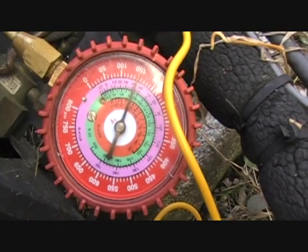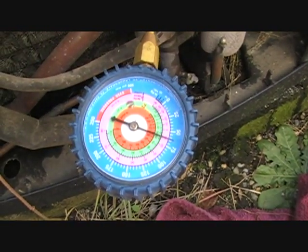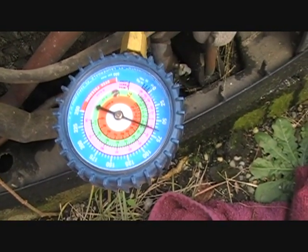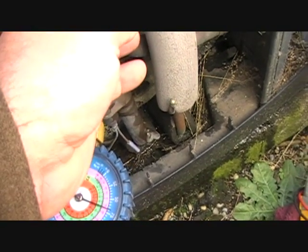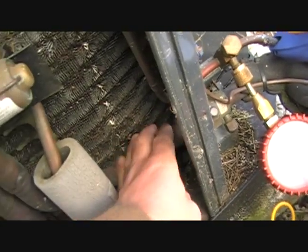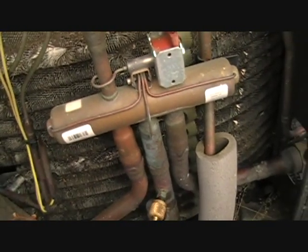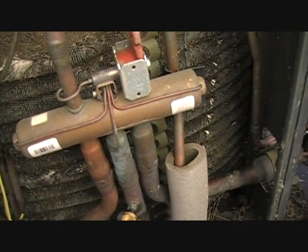Head pressure continues to rise — up a little bit because there's no fan motor running. No fan motor because we're maximizing how much heat is on that upper coil. It's switching from heat to AC just fine. Our fan is back on, blowing off the steam — and there's our whoosh. We're back in heat again.